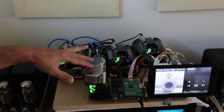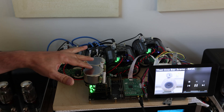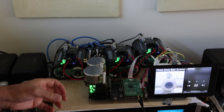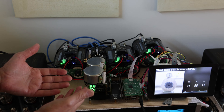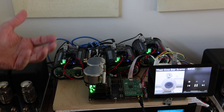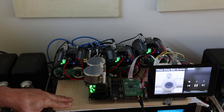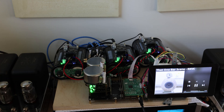In the last video I had Ivan's small transformers — I'll put a link for Ivan's below. The four transformers are the ones that basically separate the sound coming from the DAC board going to the pre-amplifier, and they help protect the pre-amplifier from any DC power or other surges. The reason I've been waiting a while: one of the previous four transformers from Ivan unfortunately may have gotten bumped in the mail. Inside one of the transformers was rattling — something broken in there. It did work, but I didn't trust it, and one channel didn't seem exactly like the other.